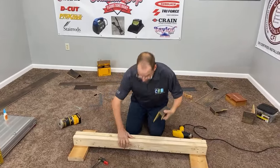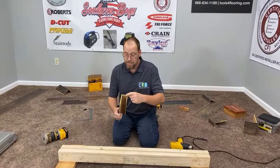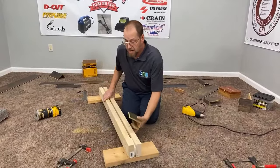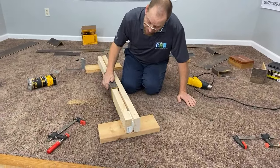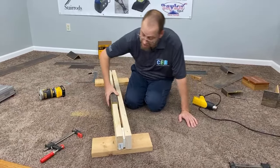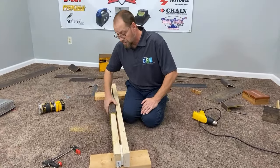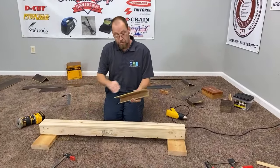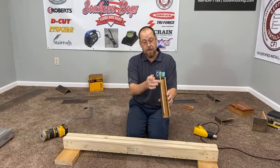This right here is the 2x12 landing. I've made my space here just the size of a 2x4, so it will actually sit right over it perfectly — nice and snug with no play. If you apply your adhesive here and on the tread just like you normally would, it's going to fit on there really solid. A benefit to this is you're not destroying the tongue or groove — you still have your locking mechanism.